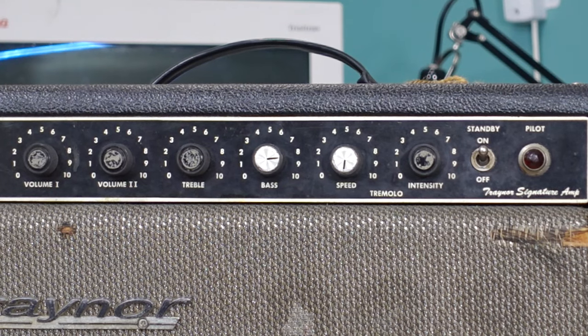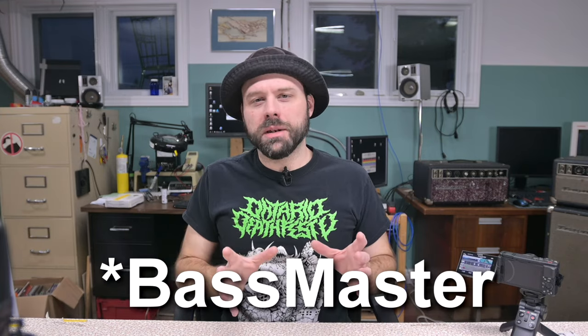These amps in testing did not go anywhere near as loud as I expected. The other major difference — though more minor — is the EQ circuit. Both the signature amp and the Bassman use your typical three-stage tone stack with treble, middle, and bass. Except the Bassman had a 'low expander' and a 'high expander' — what we know on all other amps as mid and presence respectively. The signature amp loses the presence completely and has a fixed mid. Instead, those two knob positions are replaced with tremolo speed and intensity. So they pretty much took the Bassman, changed the power supply circuit, dumbed down the voltage — probably making it cheaper — and added tremolo.